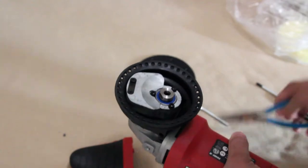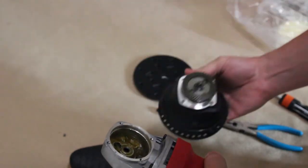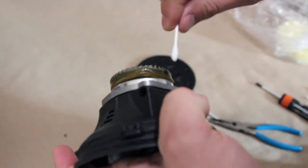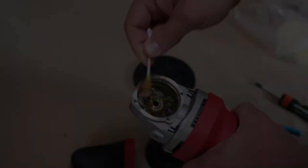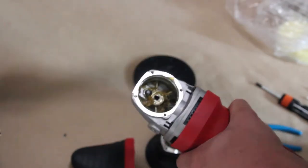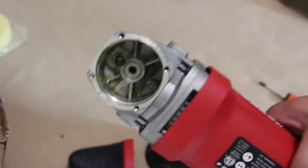What you may notice while wiggling it is that when you undo the screws that hold the transmission plate, that's also what holds the plastic counterweight shield. The wiggle seems excessive but it's really just the plastic cover being loose between the plate and the counterweight. Now that you have the plate separated, you want to remove as much of the original grease as possible — on the gears on the back side of the plate and from the main casing. I used Q-tips but you can use just about anything; just be careful not to leave anything behind.